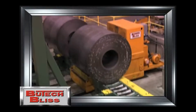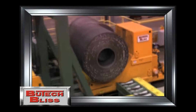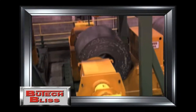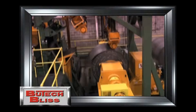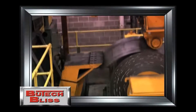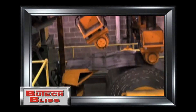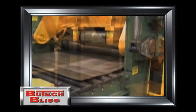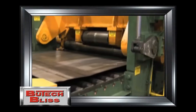The layout of entry equipment for any cut-to-length line is important for productivity. Here we see a coil being loaded from the conveyor system and then being fed into the flattener using the peeler, snubber roll, and breaker roll to manipulate the head end to insert it into the entry pinch rolls. This is a totally hands-free operation.